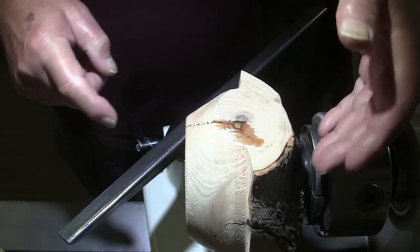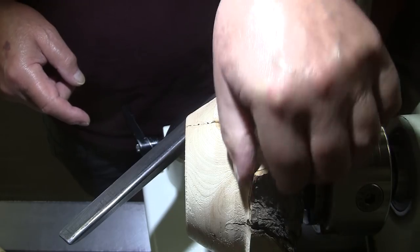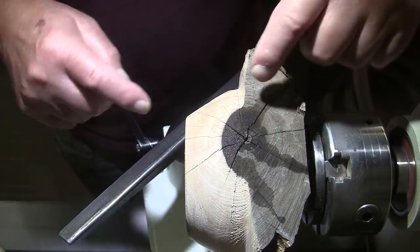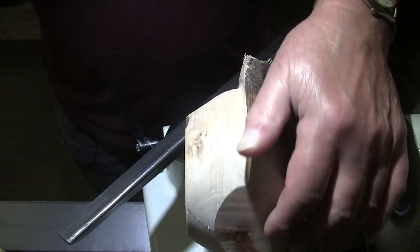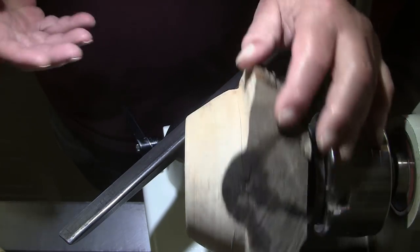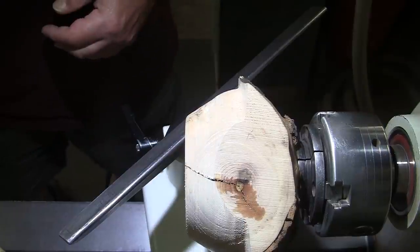And then when I work on the top side, I'll bring it down to where we have, I don't know, half an inch or quarter inch or something wing here. And that wing will be all the way around. I don't know if we'll ever get the upper half round like this will be. Maybe we will. I don't like doing that because it kind of wastes wood. It makes the bowl smaller than it needs to be, but it's not looking like anything at this point. 5/8 inch bowl gouge, about 720 RPM, mask and face shield on.